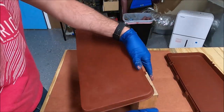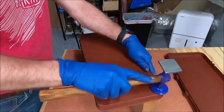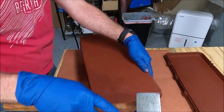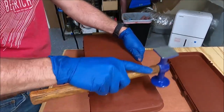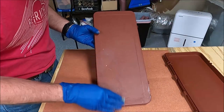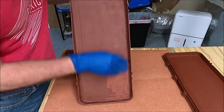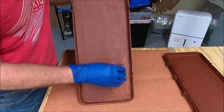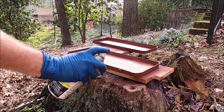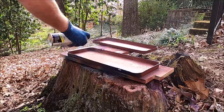So I got the block of wood out again and hammered out these last few dents, which worked out fine. Then sanded it down — 320-grit for me; go more or less aggressive if you want. I'm sure the automotive guys are making fun of me for my Bondo work here. Once all that was done, I wiped it off with some mineral spirits.